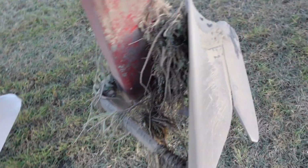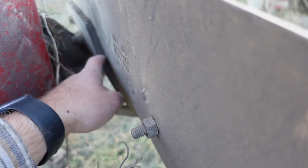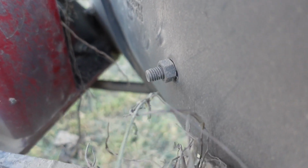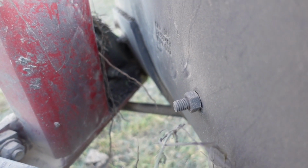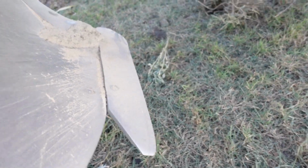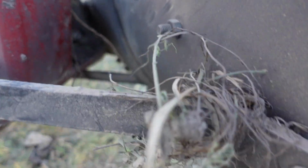You'll probably be able to see it. This one is dirty. You can see very faintly, if you look real hard, there's this, and it curves down. It kind of just makes a place for everything to attach to, like all the shares, all four bolts on the shares bolt into that, all the bolts on the mold board, all the bolts on the shins also bolt into that.